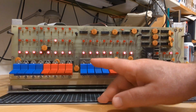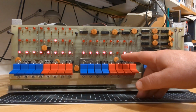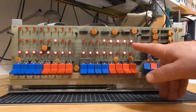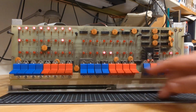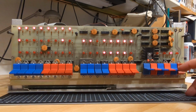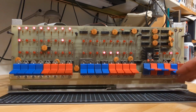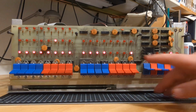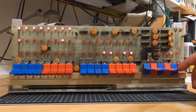And we see the same thing we saw a minute ago. There's the stack light, and we are further in memory than we were before. Is that true? There's the address that should go one less and store the other half of the return address. Then go back to executing at the restart address. Go through memory, do this again. We should see the stack continuously decrementing. And when we do, actually, we go around and around and around. We can see the stack pointer decreasing its value every single time we do this.